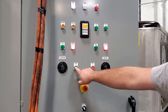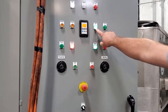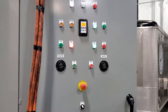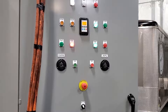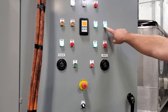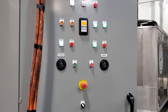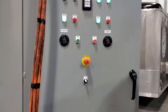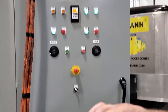So we'll start the system. Boost pump running. Inlet pressure is not built up yet. Inlet pressure is built up now. And once the inlet pressure builds up, that's when the 15 seconds will start. Then after 15 seconds, you can go to high pressure.